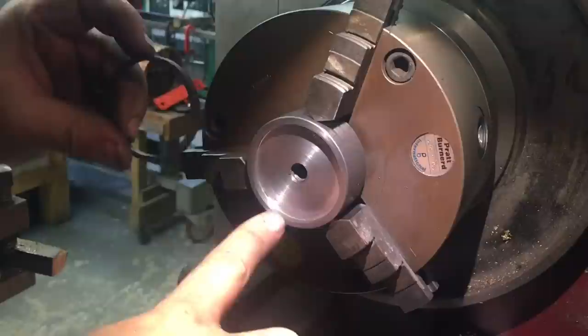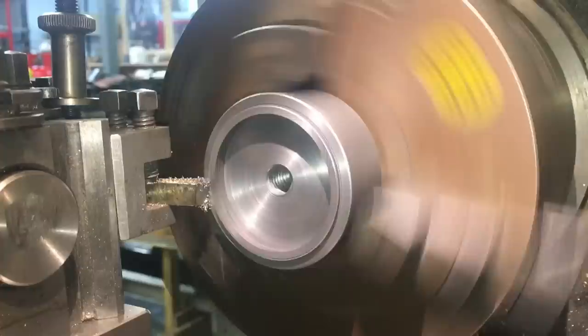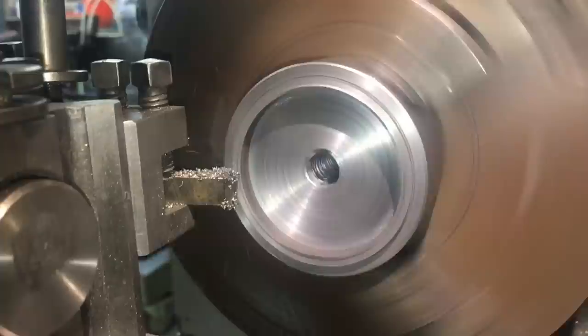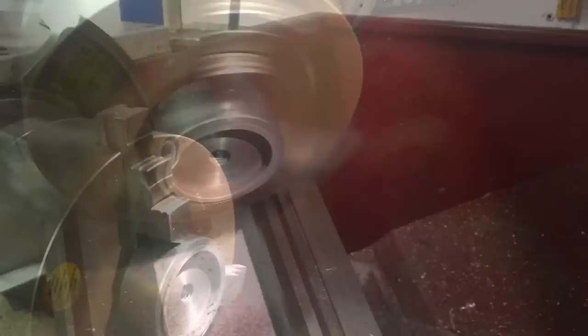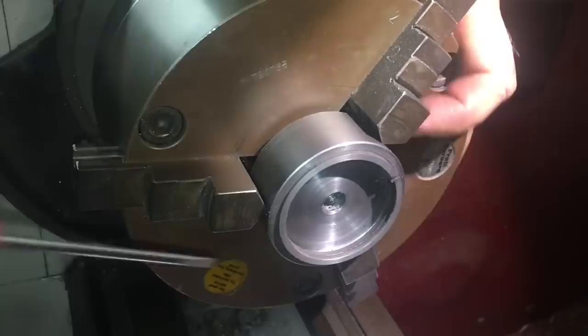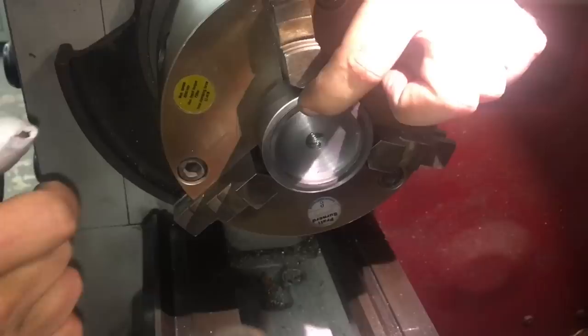This is a ring to width and depth. We're popping the ring into a widthing mandrel that is essentially oversized for the end diameter that you'd like the ring to be, because if you remember at the beginning we left an oversized surface on the ring so we can machine it down later. Pop it into the mandrel and then face off the edge that's facing you to take the width of the ring nearer to what you're after. John's just finishing off the sharp edge with some sandpaper and then popping it out carefully with a screwdriver. Then flip it over and pop it back in the mandrel the other way so you can get rid of that step.